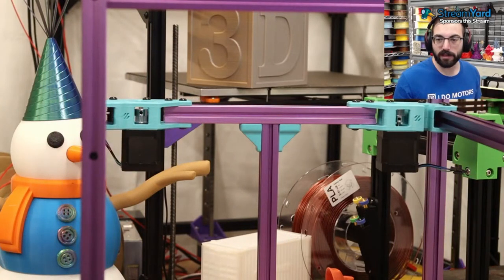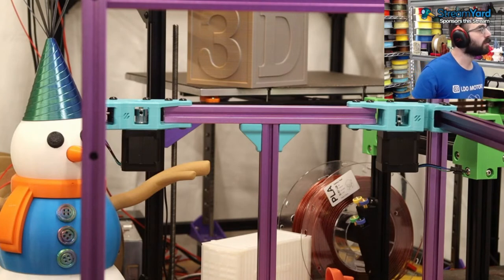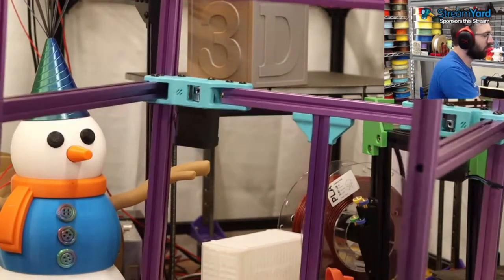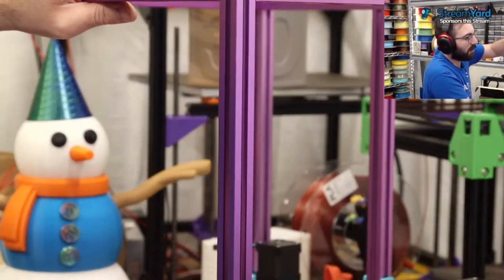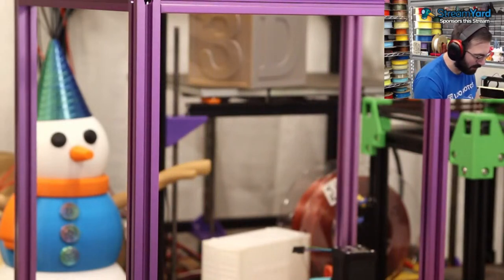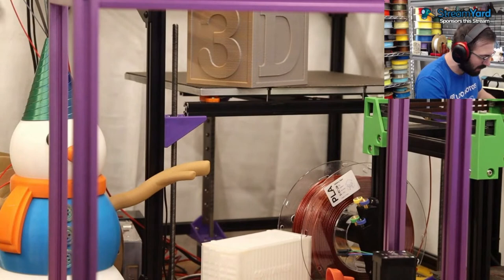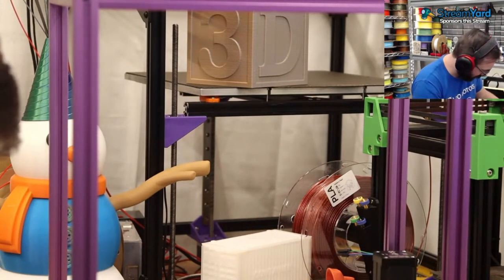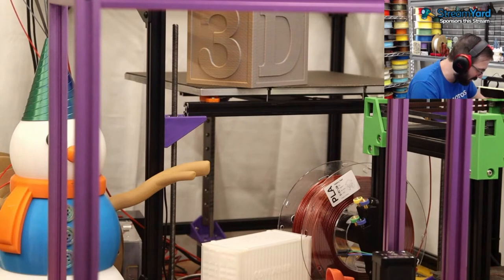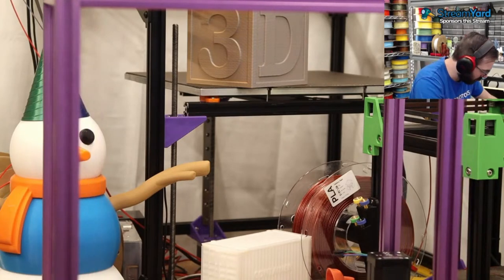All right, let's continue with this for a bit. Upside down assembly. So let's flip this upside down and square off this top again. Starting to get heavy. Same thing when I built my 2.4, the top of it, the extrusions just didn't line up. Like they weren't pressed against the table when they were installed or something. Something was wrong. So I'm just going to reattach all these extrusions. And I see what's happening, it's shifting as I screw it in. I just want to be close. It was close enough, it was good.